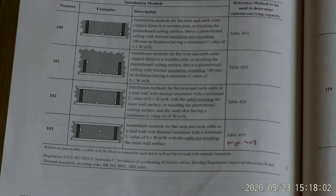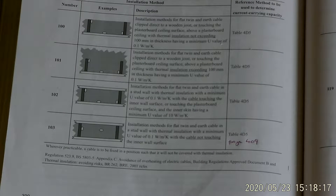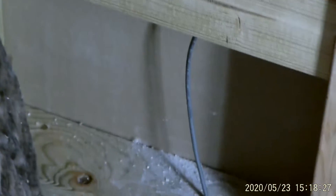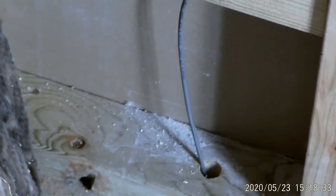I'm about to put some insulation in this wall and I want to grab this picture out of the BS 7671 - it's on page 390 and it shows you a reference method for inside walls and ceilings. What we've got here is a stud wall with thermal insulation, and I'm not clipping my cable direct to the stud - I want it to be loose at the moment. That's a bit of cat six with a pull cord.